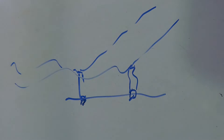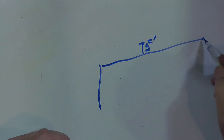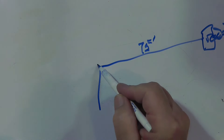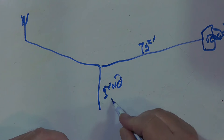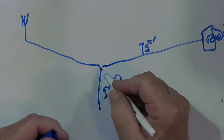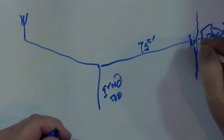Now, I'm worried about your saying that you've got 75 feet of coax, you've got a ground rod here, you've got 75 feet of coax to the radio, and another 75 feet to the antenna — and this is the ground rod. My question is: why? This ground rod should be right where your cables go into the house. That's where you should have a ground rod and put your lightning protectors.